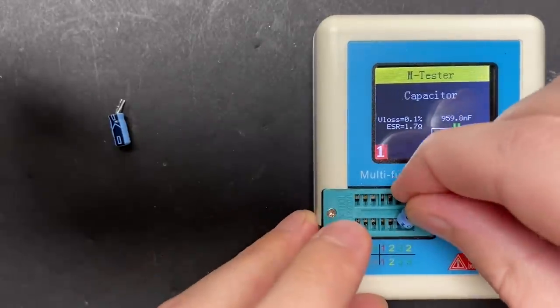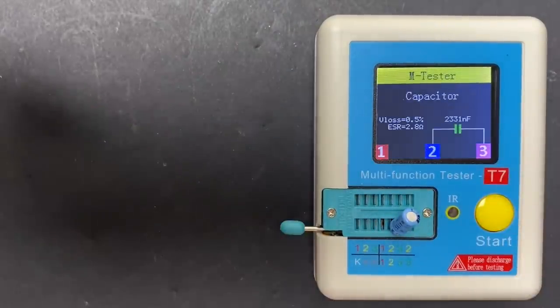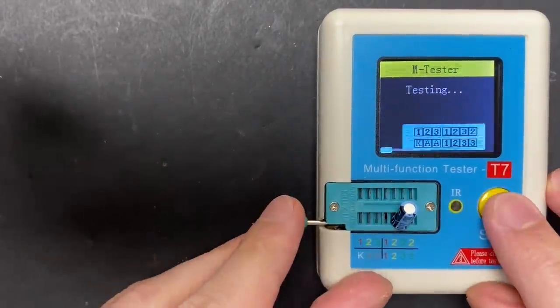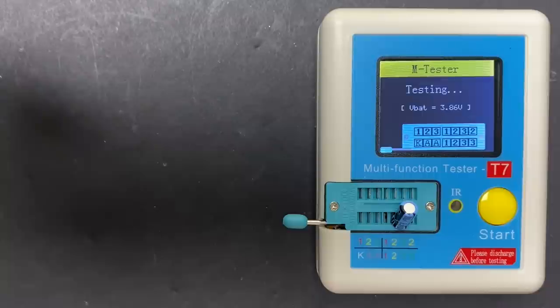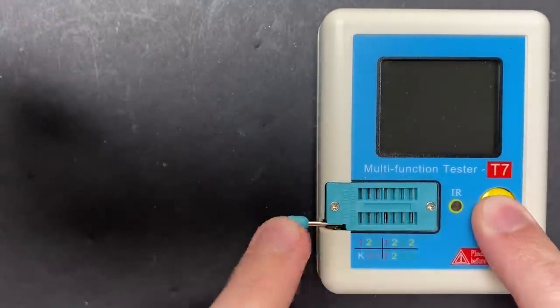Now, why did those wavy lines go away when we used the DC power supply? My best guess is that there's less circuitry involved in filtering an already clean DC signal, and you're probably just lucky for a period of time where the capacitors are half working and they don't have too much trouble filtering that DC signal.